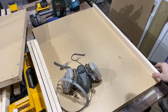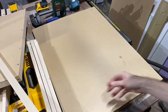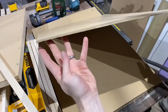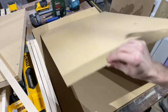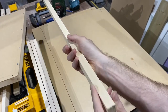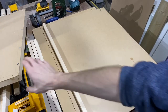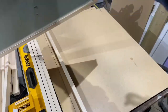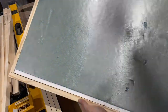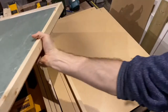Step one was to cut out these baseboards - they're made out of hardboard. Always wear a respirator if you're cutting any form of wood material. It's very thin at 3mm, which is why we're going to give it some strength with some battens. These can easily be cut with a hand saw or a chop saw, and they will go around the outside. As you can see on this example with the foam inside, it gives it a lot of structure - I cannot bend this if I try.